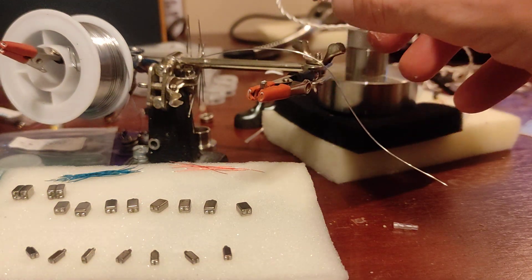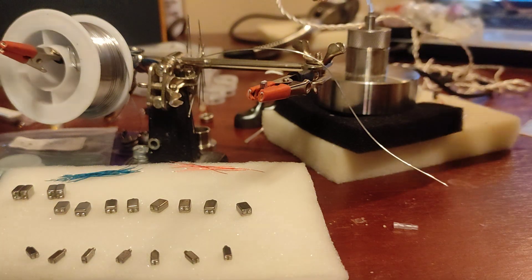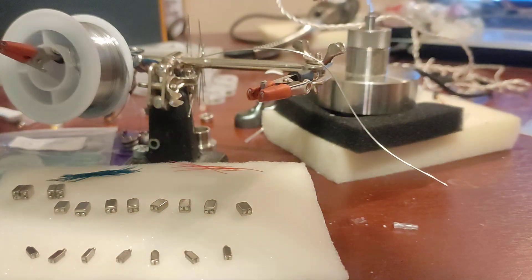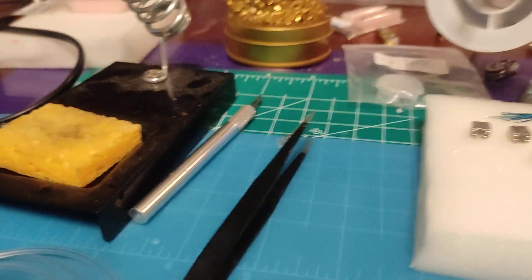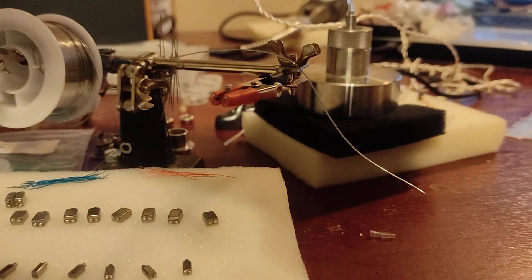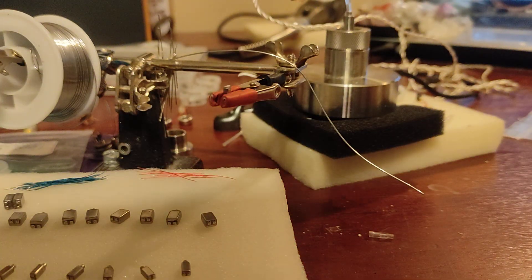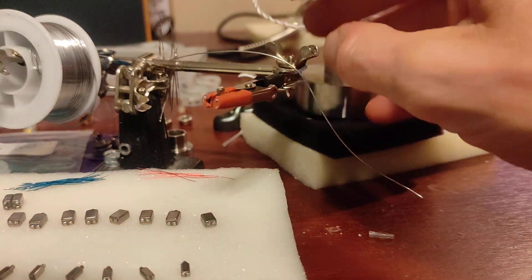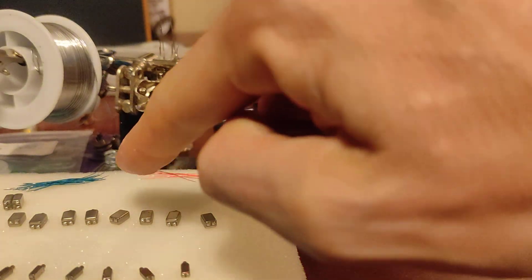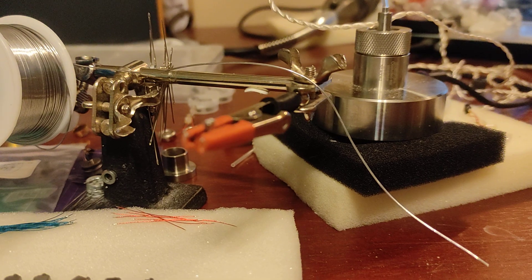I have the BA in the helping hands and I have my soldering iron. You want to make sure your tip's nice and clean. I got a little solder sponge here — you want to clean your tip. I also got some brass here. Just make sure your tip's really clean. And I have some wires laying off to the side.